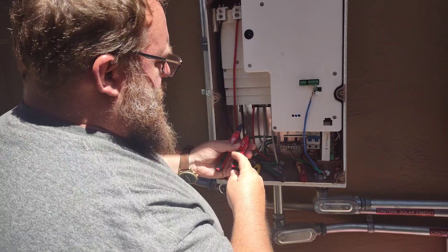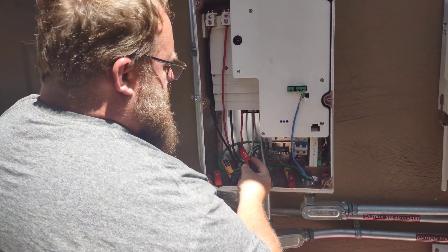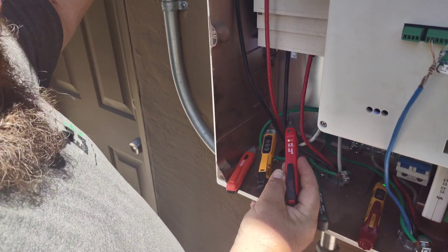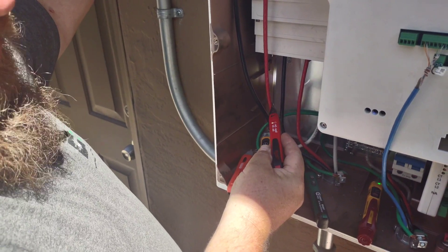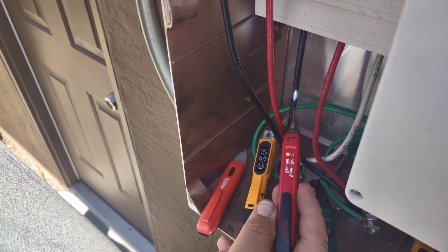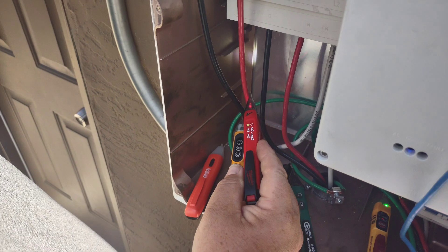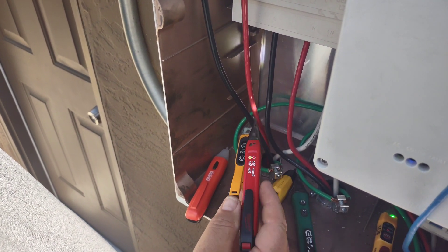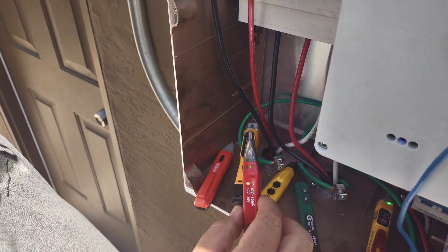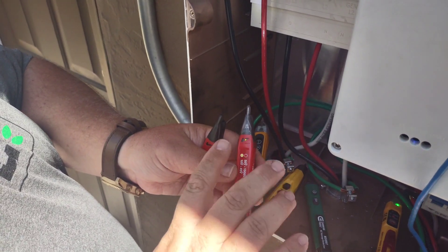What I really like about the Milwaukee version — and I'm not sponsored by Milwaukee, but I've been using them for a long time — is first, they run on regular AA batteries that anybody can find everywhere. Second, it switches over automatically. The other version, if I turn it up to the full-size high-voltage setting, only does the high voltage and doesn't do any of the other clicking. So I really like that the Milwaukee automatically switches and gives me a green light on the versions that are available.